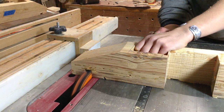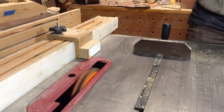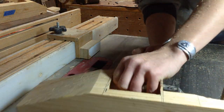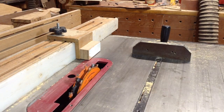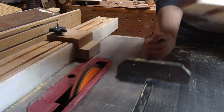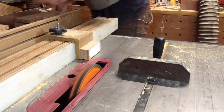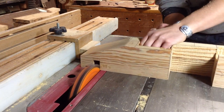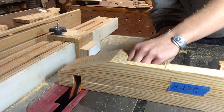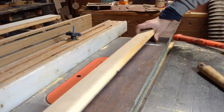I had enough scrap to make everything. Because of that stop, I can cut all of these at once — cut one side, flip it, cut the other side, then do the exact same thing on the other top part of the base. Raise up the blade for pass two, then the final pass. These look to be about an inch and a half to two inches deep. I didn't want to get too close to that cut angle so that end piece wasn't weakened.